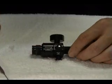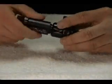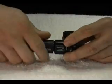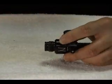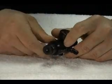First, make sure the bottle has no air in it. Screw on an ASA or adapter and safely bleed all the air out. Remove the ASA and push the pin valve. You should hear and feel no air coming out.